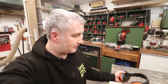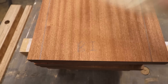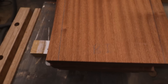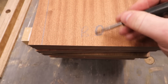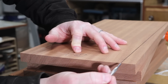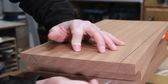I've made a mistake but I think it's going to be an easy one to resolve. When I marked up what will be the bottom inside of each board, I forgot that my dimensions actually refer to the outside face of each board, and those are the dimensions I used for the template. Therefore all I need to do is change this from bottom inside to bottom outside. If this had been my inside face then my angles would need to be cut in this direction, but now I'm treating it as the outside face my angles need to be cut in this direction instead.